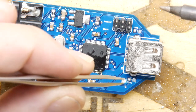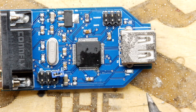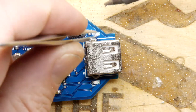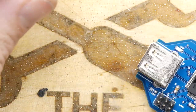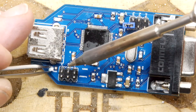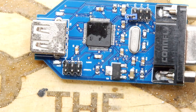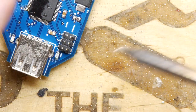The final piece of the puzzle are the LEDs. Be aware LEDs have markings on them to show which way around they need to go on the board, so take a bit of care with that. If there are instructions showing which way around, pay attention to those; if not, check the data sheets. Definitely do not hold your iron over the LED for too long or you will cook it and it will break.